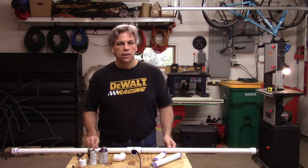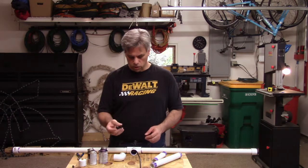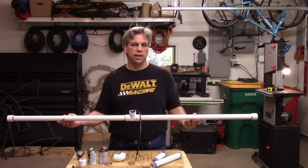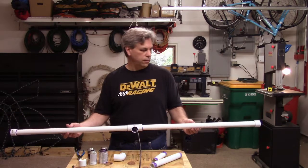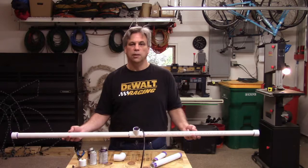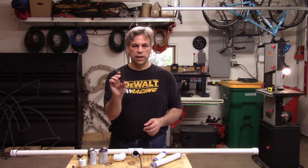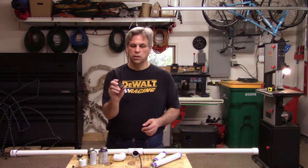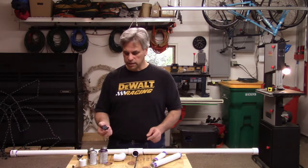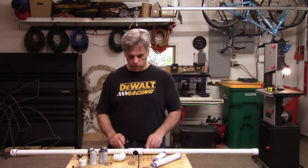Another thing that you can do is to put what's called a balun on your coax line. Coax is an unbalanced transmission where a dipole antenna is considered to be a balanced method. I'm not going to go into what all that means — partly because I don't even understand it all myself — but I've always seen these little ferrite connectors before and they are there to help reduce noise and interference that can come on a line. It's been recommended, although not 100% necessary, to add them right at the point where our coax cable connects to our antenna line.